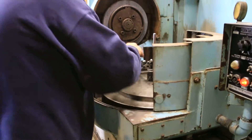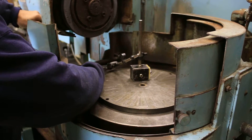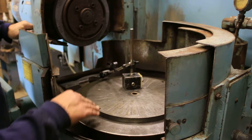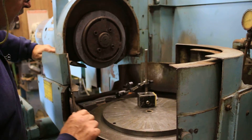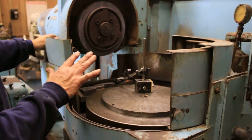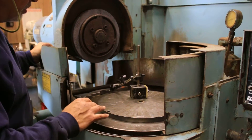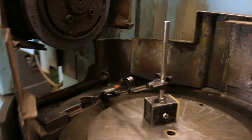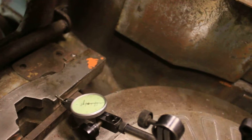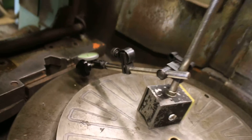There's only a certain amount of travel in this dresser bracket. Your diamond would be mounted here, and most of your travel down to the diamond is done with the hand wheel. This adjustment here is not meant to keep going and going — you only get a few thousandths, maybe ten thousandths, of travel on this bracket to adjust your diamond and change your dressing amount. You can see the indicator dial — watch how it comes up and goes back down again. That's all this does. It's all been freed up and working properly.